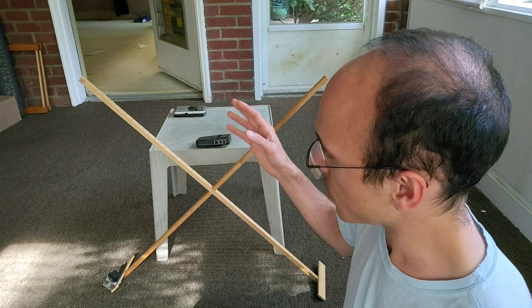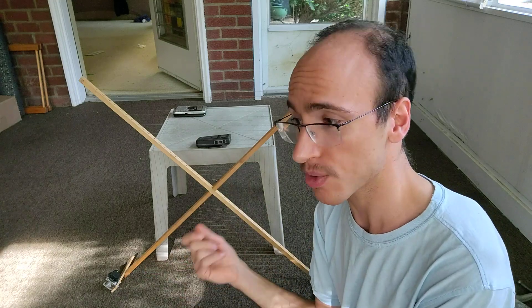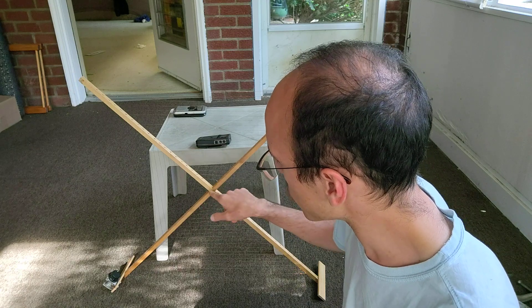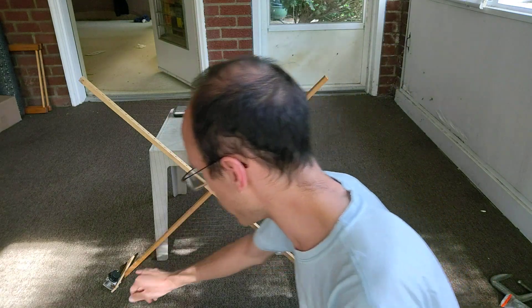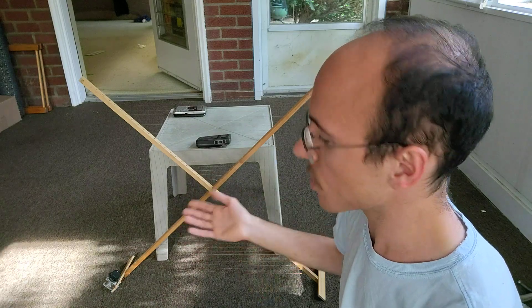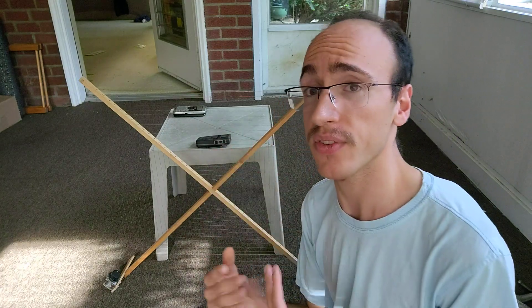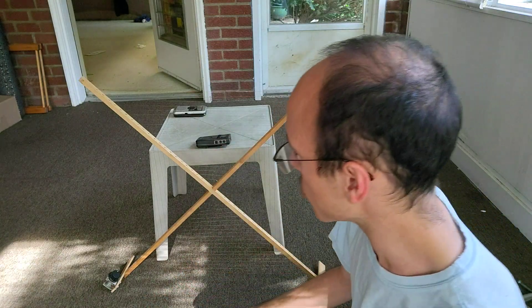But before I did that, I needed to drill holes in order to hold the wire for the loop. Now this is a spiral pattern that's actually really good for directionality - the inductance is highest from the beginning to the end of the loop. So you'll notice the strongest gain towards the center of the loop, which helps a lot with directionality, whereas it would all be even if I had just wrapped around a box or a circular frame.